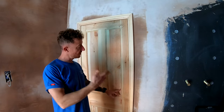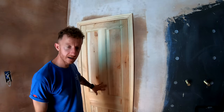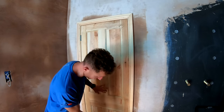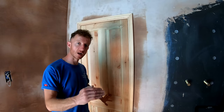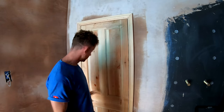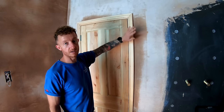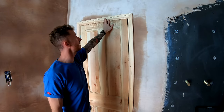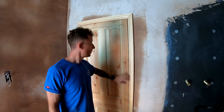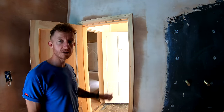The architrave's all on and the door's in. We may have to do some adjustment with the bottom of the door later - I'm going to leave that until the floor is sanded, because obviously that will change the level of the floor. We don't want to chop stuff off the bottom of the door and then find the floor's been lowered, leaving too big a gap. All the pins are still sticking out just in case we need to move anything, but they would all obviously be pushed in. Now we need to go to the other side of the door.